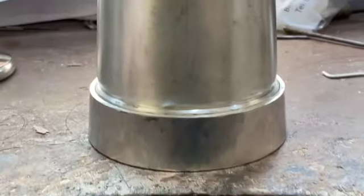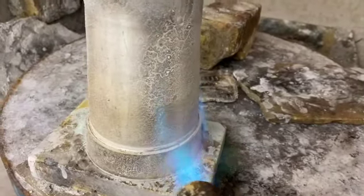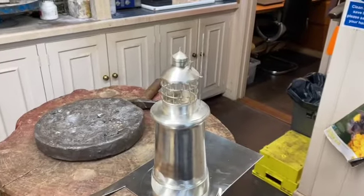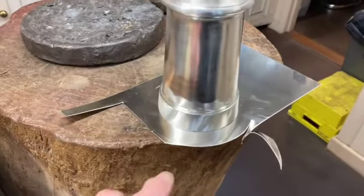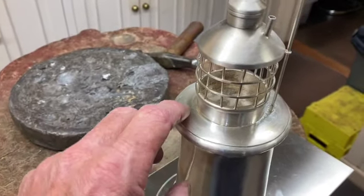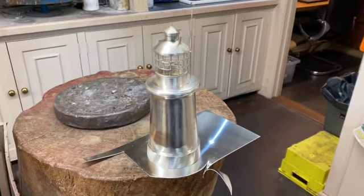So I've just got to fit that a little bit more and then solder that down. I've done a few more bits and pieces like putting the little aerial on the top and the little spigot to take the weather vane. But what I've got to do is make this bottom section here. I've already marked it out in a piece of silver and I'm just going to carry on cutting it out. And then it's got to be finished in a satin finish — this piece here and this here — because when the railings go up, if the people working inside the lighthouse are out walking, we want non-slip finishes on. So I'm going to cut that out, dome it slightly, and then that will be soldered down onto the main body.